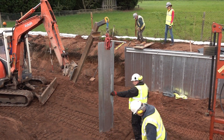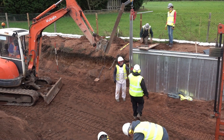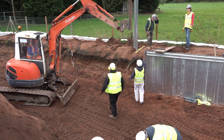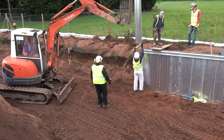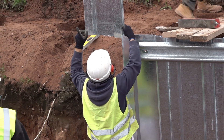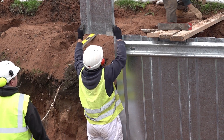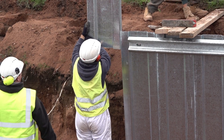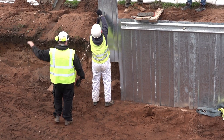One of the things we do, as we did yesterday, is in fact do a toolbox talk. That started the whole operation — talk everybody through to make sure they all know what they're doing and who's doing what. Please be aware that when machines are moving you don't stand behind them or beside machines — you'll get crushed. Make sure if you are anywhere near an excavator, or want to come within range of one, eyeball the driver and make sure he gives you the thumbs up that you can go somewhere and he knows you're going there.